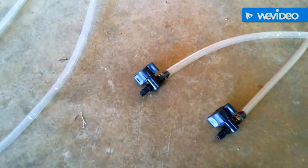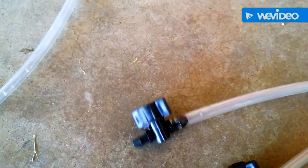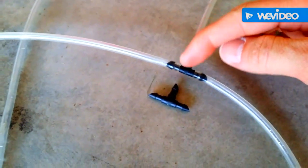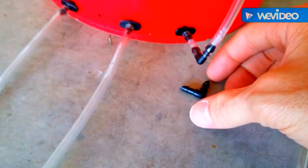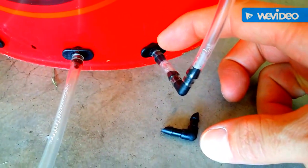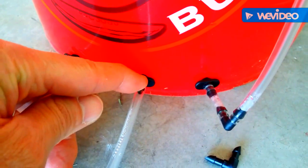This is the on/off valve — it's only located at the end. This is a view from the top and from the side. You don't have to worry about memorizing this because there's going to be a ton of information in the description below. Anywhere you want to split in your design you will need a T-fitting. There's your T and the elbow — I only use the elbow at the bottom and top of the sight glass. As for this connector, what you see on the outside is identical to what's on the inside.